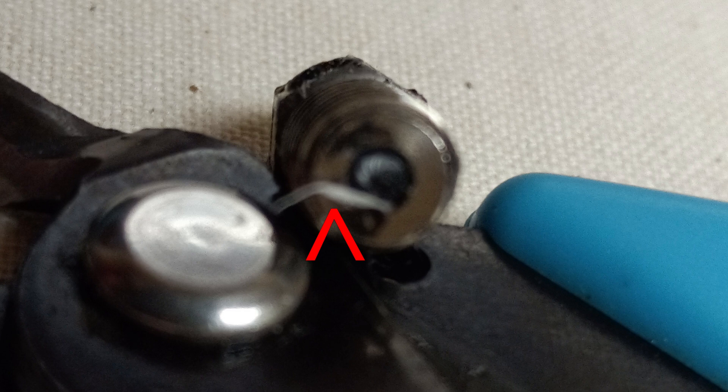Off the printer the nozzle came again. Can you see that little white thing in there? That's the Teflon tape — it wedged itself in there, and together with the PLA that seeped everywhere afterwards, it clogged up the nozzle quite nicely. But it did print a full Banshee, so I guess I was somewhat on the right track. A new tool needed to be acquired.